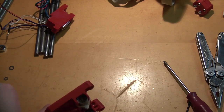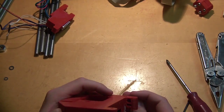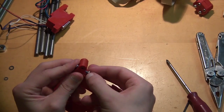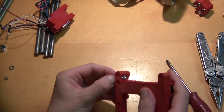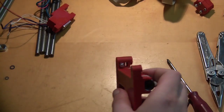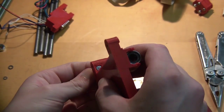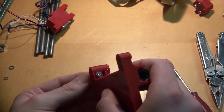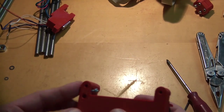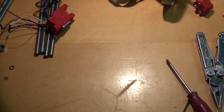This is part of the belt tensioning system. So you take a normal 3mm screw and then you just put a normal M3 nut in there — no nylock nut, a normal M3 nut. See if you can actually pull it in. If not, you have to use a lighter to heat the nut up a little bit to be able to pull it all the way in. But if it fits in, that's all right. You don't really have to fasten it that much — it's just so that it remains in place. Just leave it like this. You will see later what this is for.